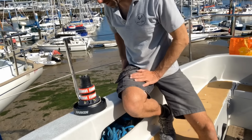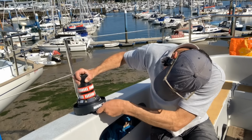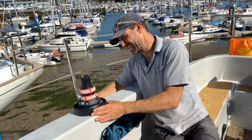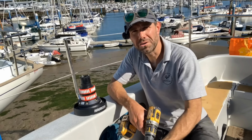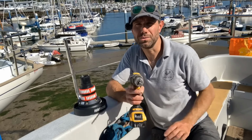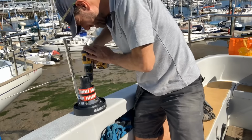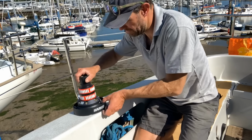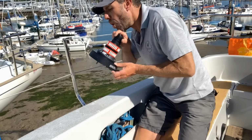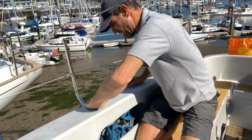so I can just knock a drill through the rest of these things. In fact, I haven't actually got that in the right location. Let's try that again. In there. Now it really can't move very far at all, and I can mark off the other three holes. And because I don't want to cover the winch in dust, take that off again, and I can drill the rest of the holes. And it is as simple as that.